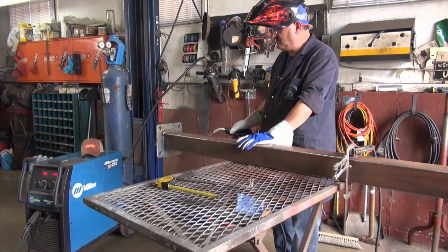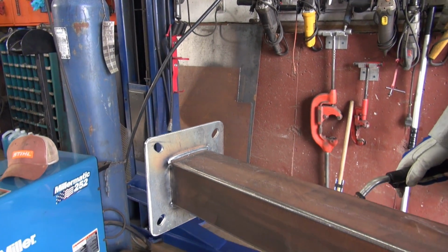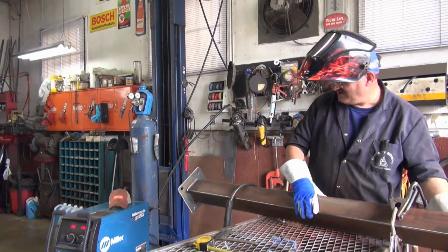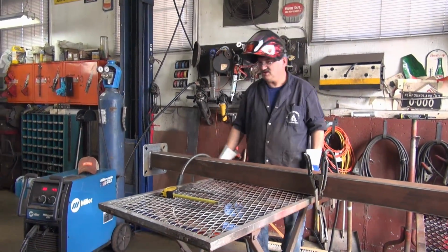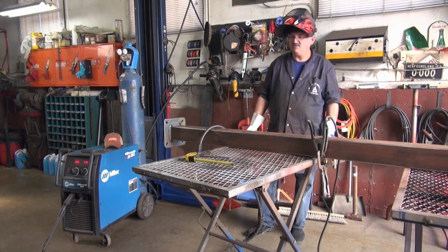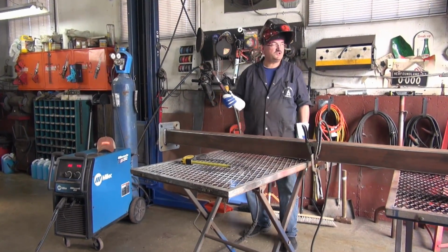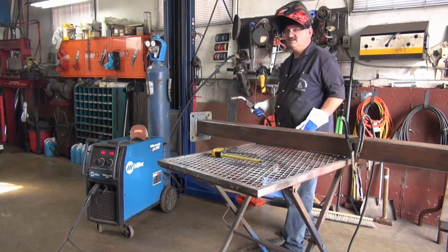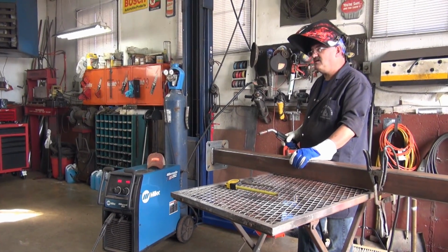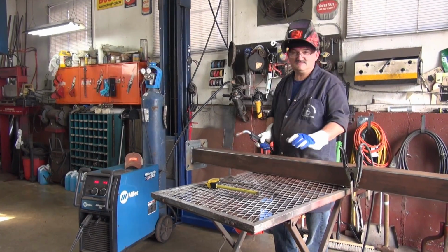Do I show them the weld? Yeah, that's smooth. And it's good penetration, so it's very strong. But I don't advise people to do it this way unless you're really used to it, because things can go real bad, real fast, and you won't be happy, especially when you start burning holes through. You've got to have your torch angle at least 30 degrees, and you don't want to be a marathon runner, but you don't want to be slow doing it, because 1/8 is pretty thin.